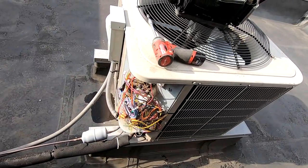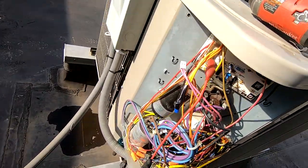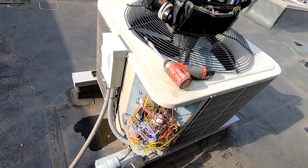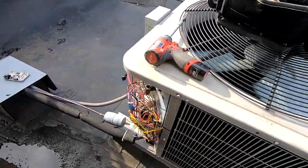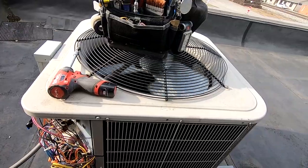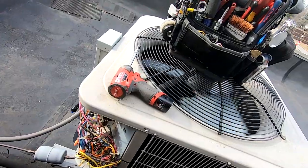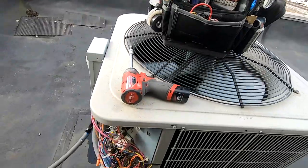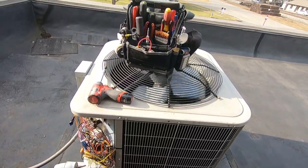Put it back into defrost again. This time I bypassed the defrost switch to see if opening it terminates defrost immediately — and it does, so the switch is opening up correctly. Instead of sensing on the coil, they're actually sensing in the airstream, which is different from anything I've seen. It's going to be either time or temperature generally, with a maximum of about 10 minutes. I know my Lennox stuff better than my Carrier, but that's going to wrap this one up.